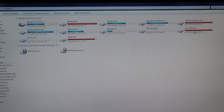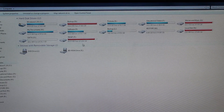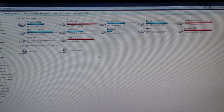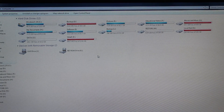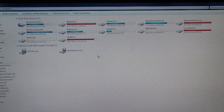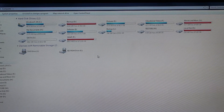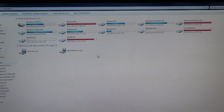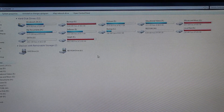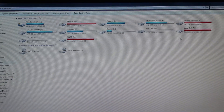We can see his local disk right here, a data partition, and a swap — 86 out of a gigabyte. But there it is! I'll be able to take the data off and put it on a different hard drive, because that's what you'd want to do. There's no telling if the motor spinning the platters or the read/write heads are damaged, so you can't just replace it and move on — you need to get your data off as soon as possible.